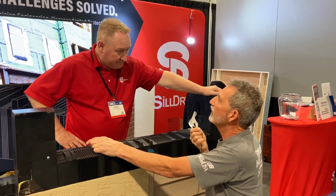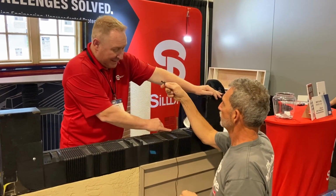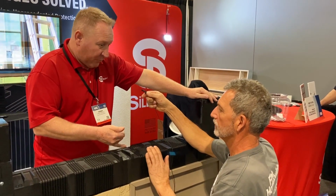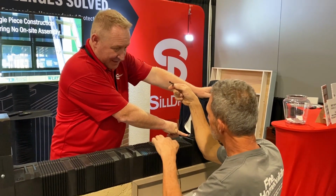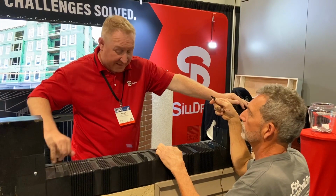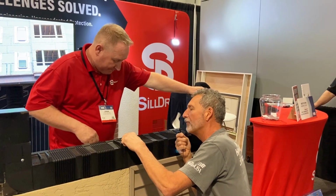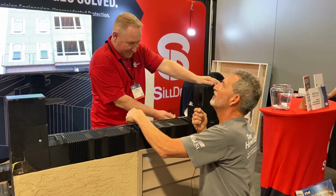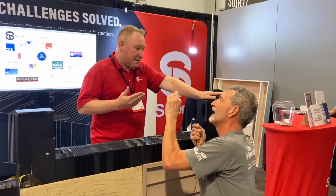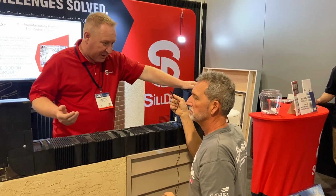So where are we going to be doing our air seal and our water seal when we want to bond it to the window? You're going to have your air seal. The reason that we didn't do a 90 back dam, we did a 1/2 inch slope with a 1/4 inch raised dam, is because these shims actually set up a 3/16 of an inch. So we'll use a 3/16 of an inch backer rod and caulk joint back here. This is dead man's land. In other words, because these ribs are up 3/16 of an inch, I'm forced to leave that space wide enough so I can fit the backer rod and then seal it. Exactly. So it's not too tight, which some guys will get down so close they can't get a good seal in there. You got it. So that leaves us a 1/4 of an inch caulk joint along the back.